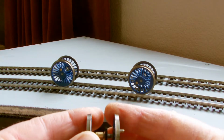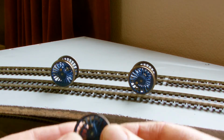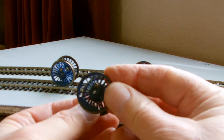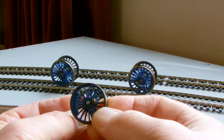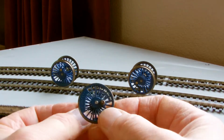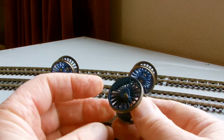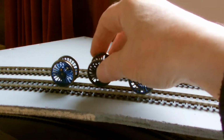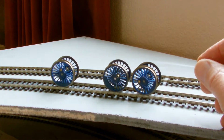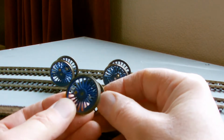And what happened was that the quartering, now the quartering is when we look at the wheel on this side, so that's pointing to the top. And when we look at the wheel on this side, that should be pointing to the side when the other one is pointing to the top. And it has to be within 1 or 2 degrees, exactly 90 degrees. And this is what's been causing my problems. So I made sure that the quartering here was exactly 90 degrees